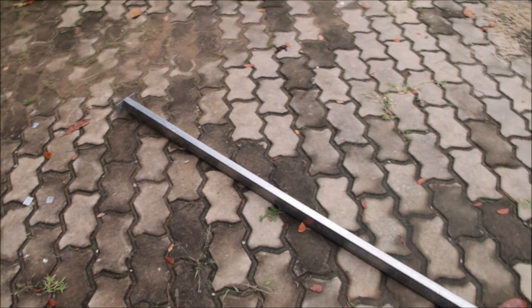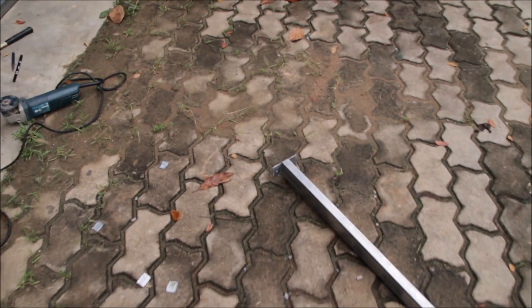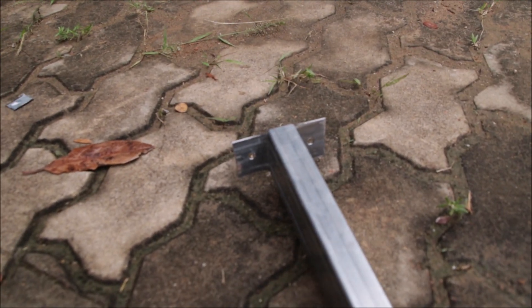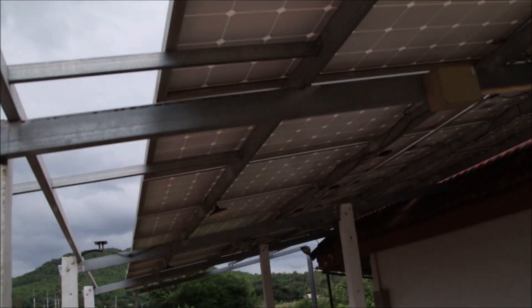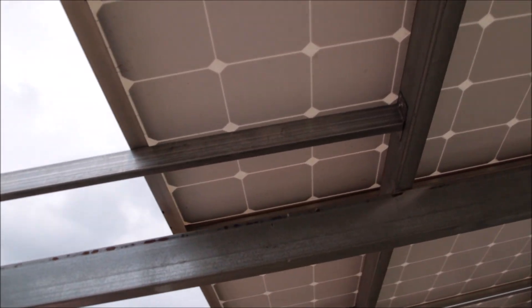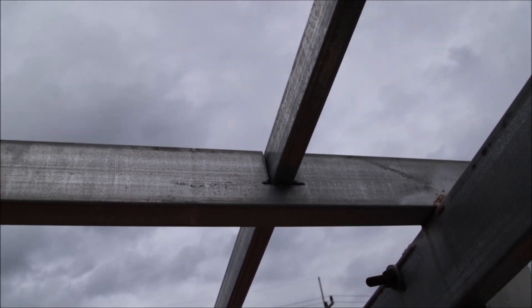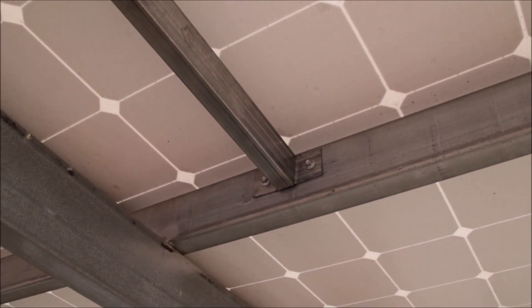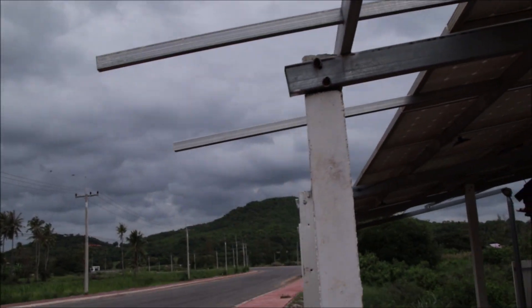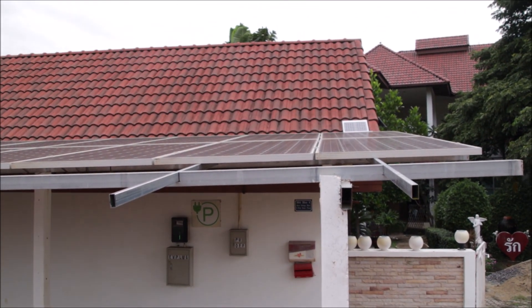For that purpose I made these beams from 1 by 2 inch steel. On one side I've put ears with two holes, and this goes into the mount. On the main beam I had to do some cutouts for the steel, and on this side it's screwed into the other beam. The new panels can lay on these two steel beams.